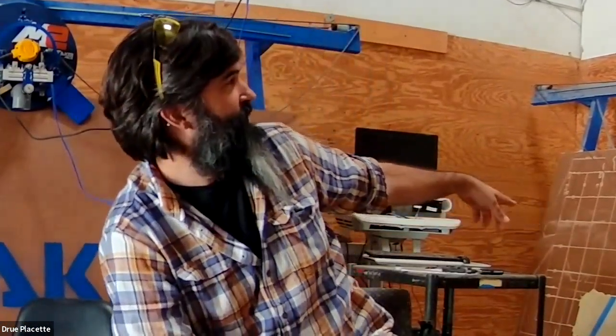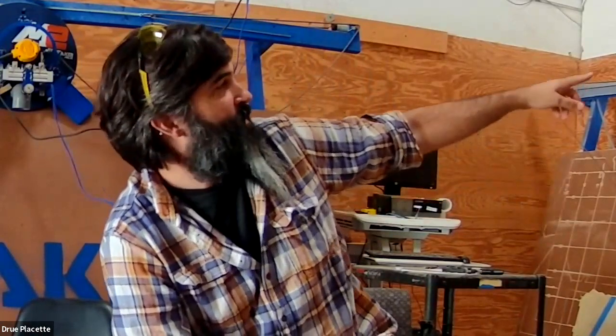So Drew painted on his wasteboard, and mine over here is the one that's been used the most. But dude, one of my gears ripped itself off last night. I had to repair it. What happened? Did it get caught in the wood? No, I think the set screw started to back out, and I wasn't paying attention. I looked up as soon as it plinged off. That was my bad. I didn't tighten it.